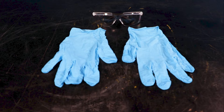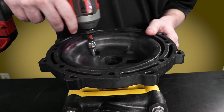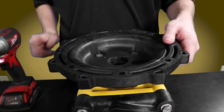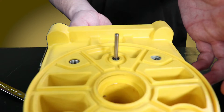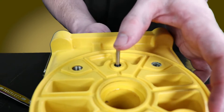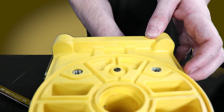If your pump has come into contact with any hazardous material or chemicals, please wear the proper PPE such as nitrile gloves and eye protection. We will be removing the cap screws that hold the inner chamber to the center section using the 7/32nd inch hex wrench. Next, remove the actuator pins, O-rings, and seals and the U-cup seal from the center section.